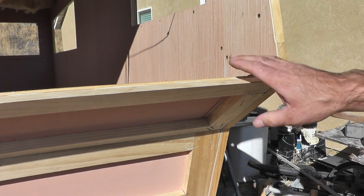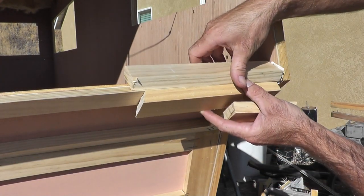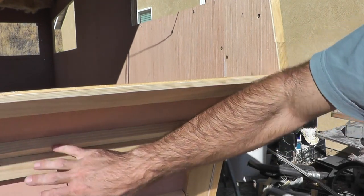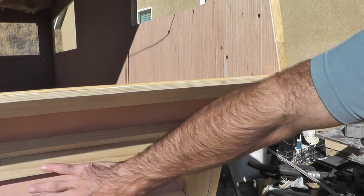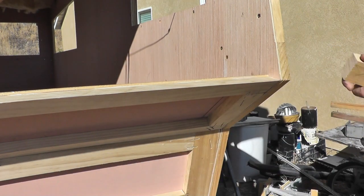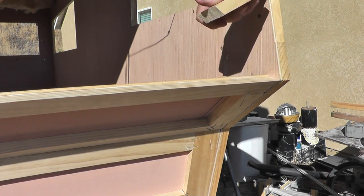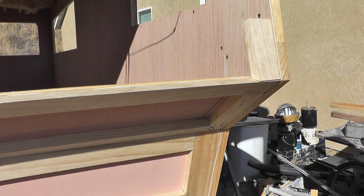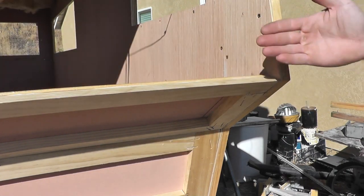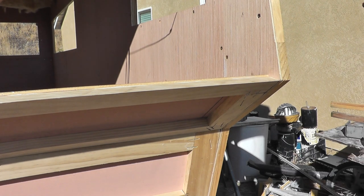I'm just about ready to install the top portion of this front wall. In the original design, the framing didn't have these nice angled cuts — it just had square cut boards — but I thought this design would be a little bit stronger. When I cut the first board, I tried to use my geometry and my square but made a mistake and had to cut it twice. On the second piece I did it differently: I cut a block of wood at an angle I thought would be close, then gradually changed the angle little by little until it matched up with the wall, and then set my table saw to that same angle. A little bit of guess-and-check rather than trying to calculate it spot on. The panel is in the garage, on deck, and ready to go.